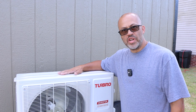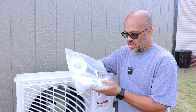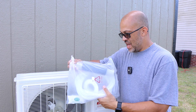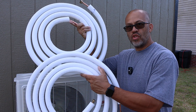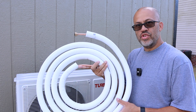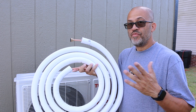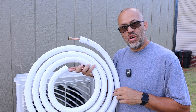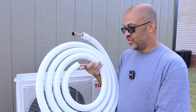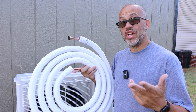Let me show you what came in the box with the condenser unit. You've got a bag of stuff, another drain hose, some connections, putty for the wall penetration hole, tape to wrap up the lines, foam for the ends, and both condenser lines for the inlet and exit connecting the indoor and outdoor units. These units are not quick-connect, so you will need a vacuum pump to pull the lines under vacuum. I have one and I'll walk through that in the installation video. The lines are pre-made — you just make the connections, torque them down, pull a vacuum, then release the refrigerant and check for leaks.